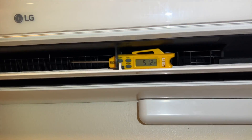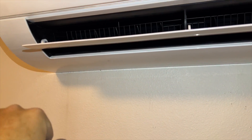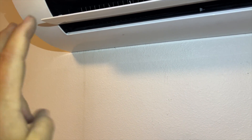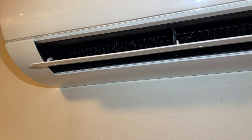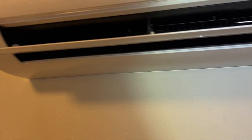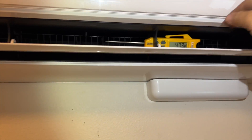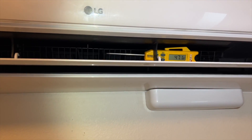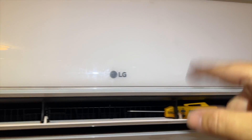The new pump is installed and she's blowing cold. They told me not to bother checking the refrigerant charge — apparently this one was supposedly fixed already. There is an oil stain here, so it looks like somebody did a charge and go. As of now it's working and they didn't authorize additional time to check the charge. I also cleaned the filter — always check the filters on these.